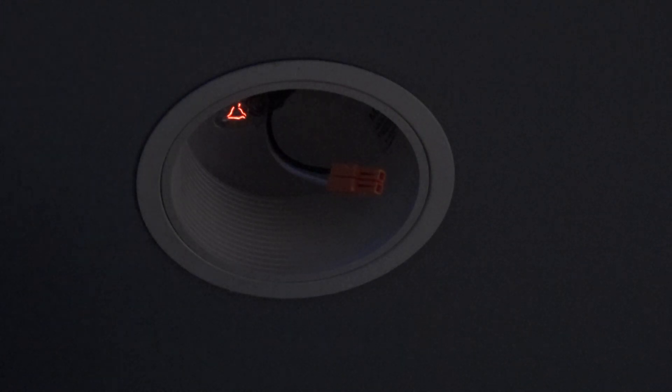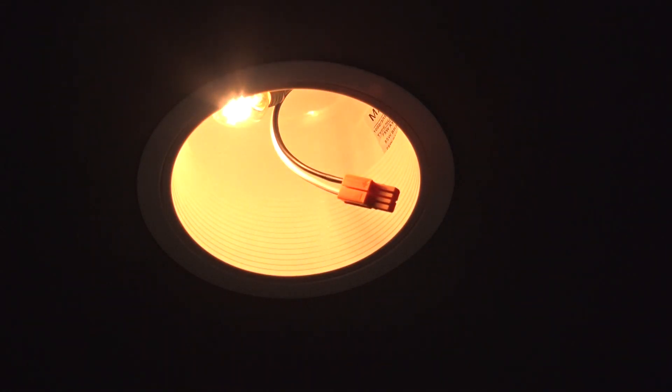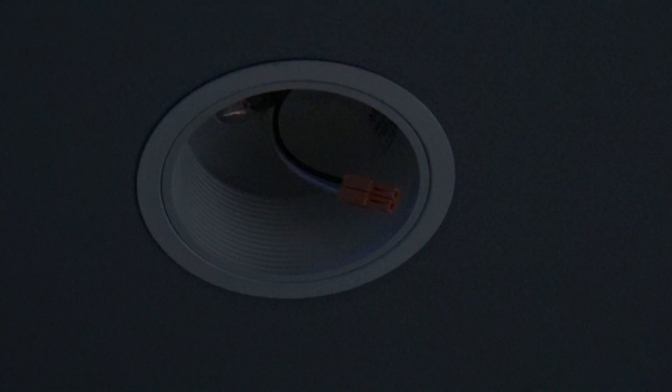I now replace the adapter into the light socket in the standard 5-inch recessed bucket. As you can see the bulb is just hanging in the bucket — it's glowing a bit because the dimmer isn't turned off completely right now — but let's power cycle the dimmer up and down. There it is — it's out completely. Now I'll plug the LED into the connector, and you'll see that it is no longer glowing as it was before.